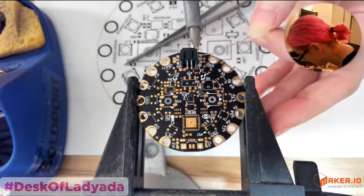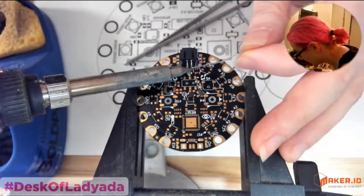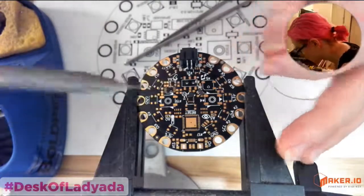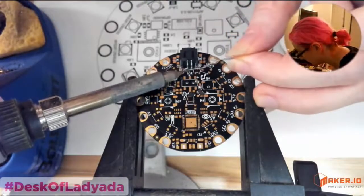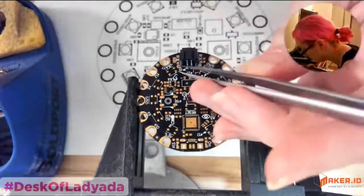Through-hole soldering is like a hand or a selective solder machine process. You want to minimize that, because soldering something that's through-hole will cost you 25 cents or 50 cents a piece, whereas soldering something that is surface mount is like 2 cents a piece. It adds up quite a bit if you have 50 components, which is not unusual.